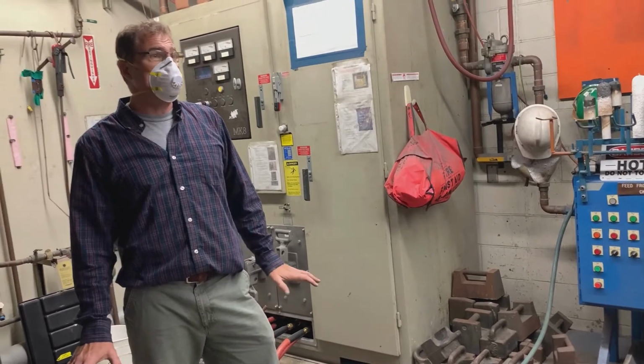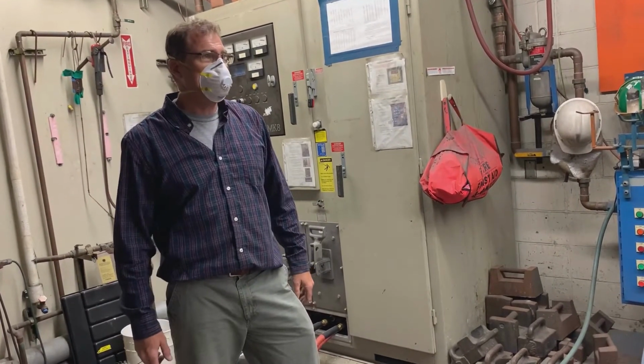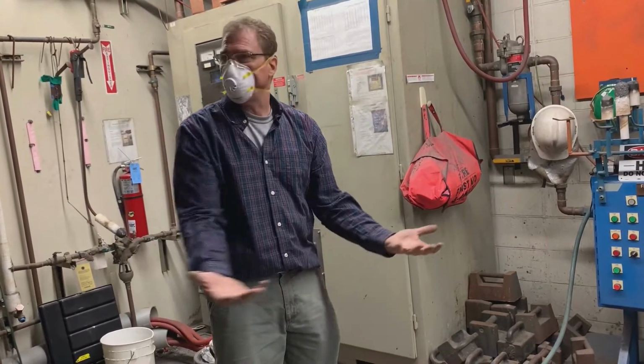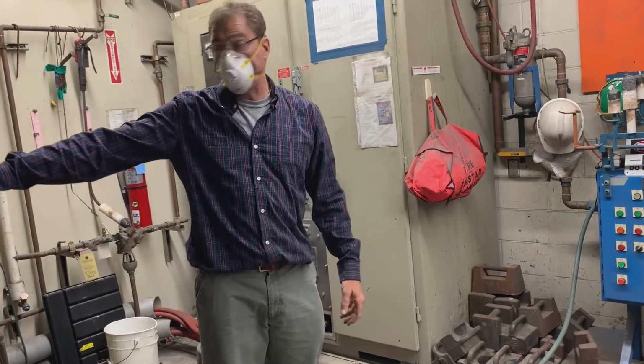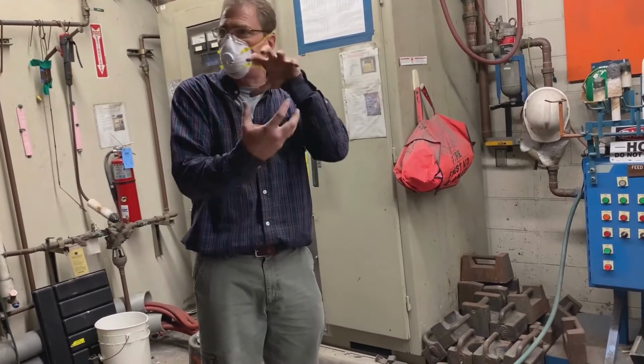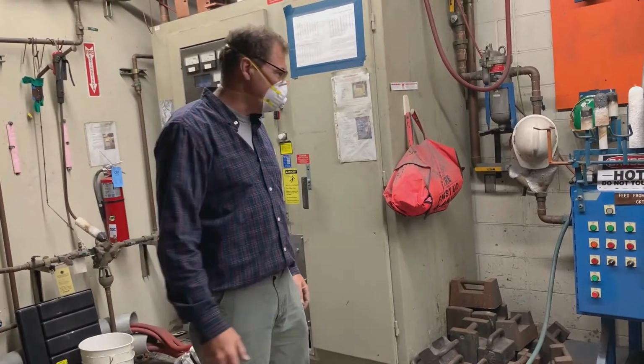Luckily it was like 10 degrees out, and so I had all the students go home and get their box fans from their door, and we put a whole bunch of fans underneath it, and we actually got through the night because we were halfway done melting. When you're halfway done melting, you can't empty it because it's all melt welded together, but it's not liquid yet, right?